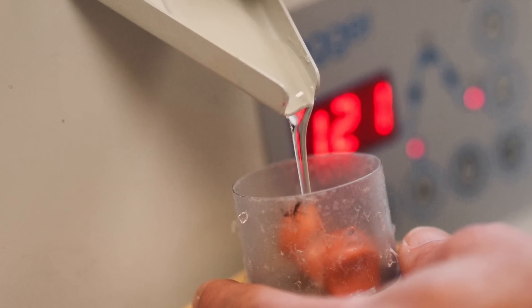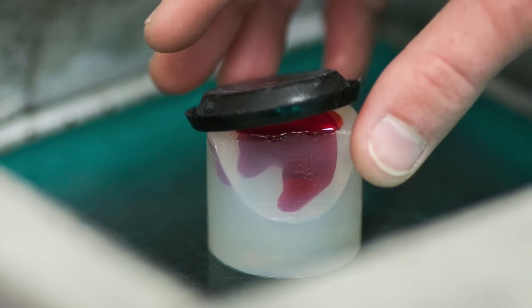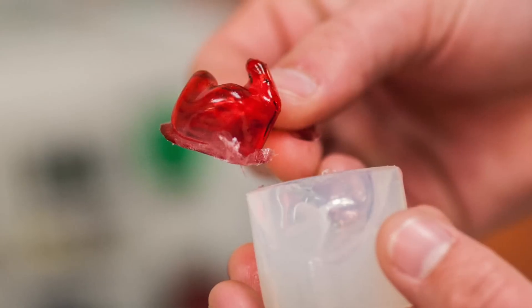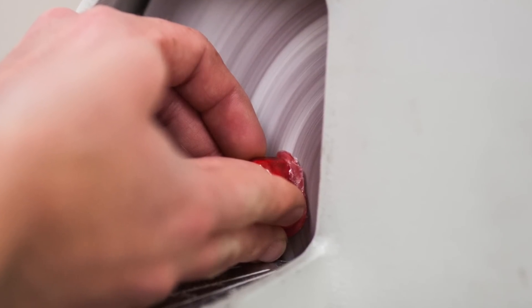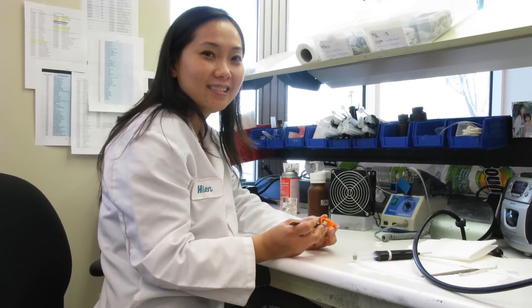Sometimes they even have to add material to improve areas of the impression for better sealing or to fill in imperfections in the silicone. Once they're done shaping, trimming, and contouring the silicone impressions to size, those impressions are used to make a mold into which acrylic is poured, and that acrylic is cured to form the final shell. What they pull from that mold is the main part of the custom in-ear monitor shell. But the shell still isn't done — it has to be buffed and polished, which is a subtractive material process, and that has to be factored into the overall process.